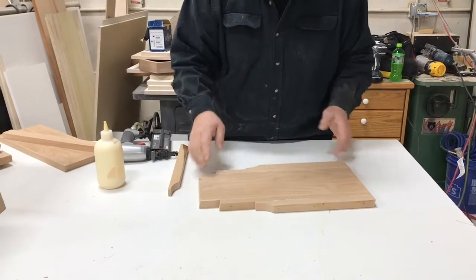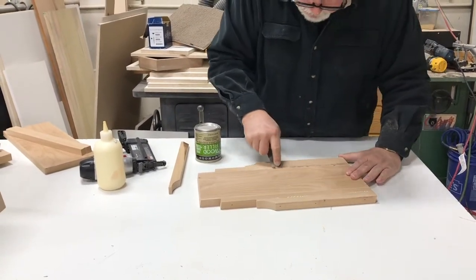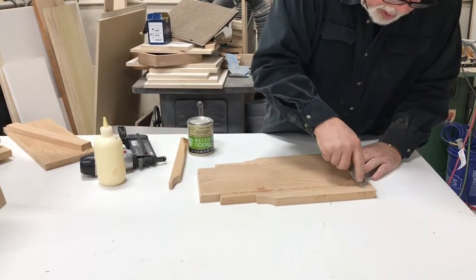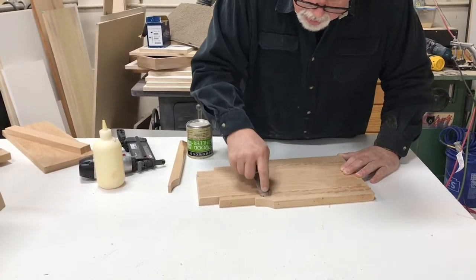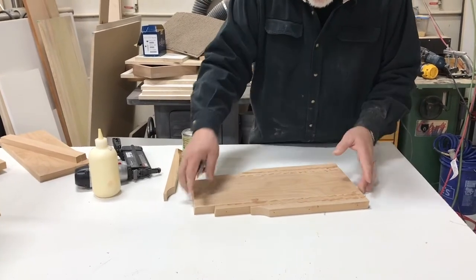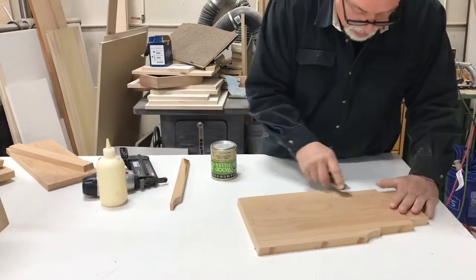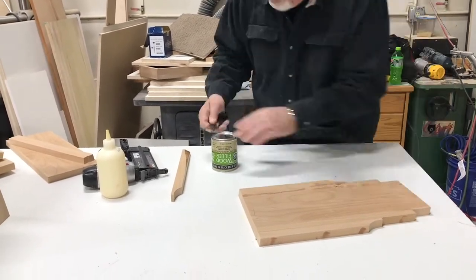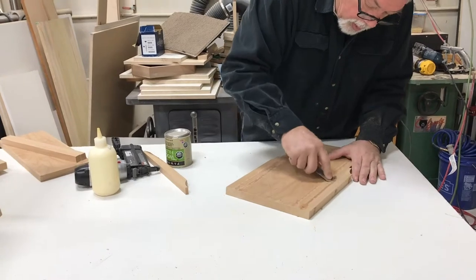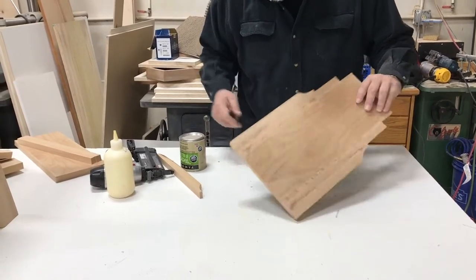Let's go ahead and put some putty on it. Let the putty dry while we move on to the next part. When you're puttying, fill all the cracks and all the nail holes even if it doesn't look like it needs it — because when you sand, you want to make sure that your sanding fills everything, covers everything, and makes everything smooth. We're ready to let that set off to the side and let the putty dry while we move on to the next phase.